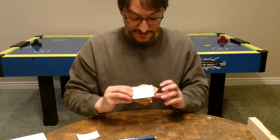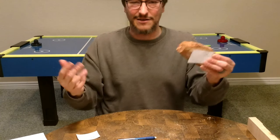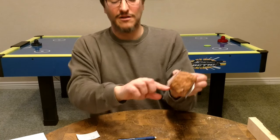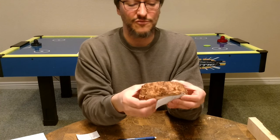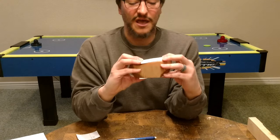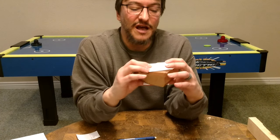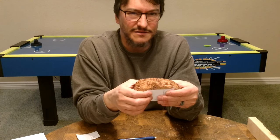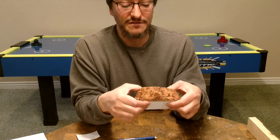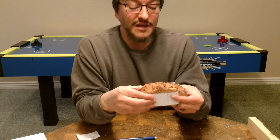I need to look down from the top to get the templates lined up on both sides so it doesn't end up as a diagonal pipe. I'll cut the templates out along the spiral lines and affix them to the wood, then lay out my bores right on the paper. I don't think I need a band saw — the block isn't that big and the little 1-by-30 inch belt sander will be easier and let me check both sides as I go without committing too early.